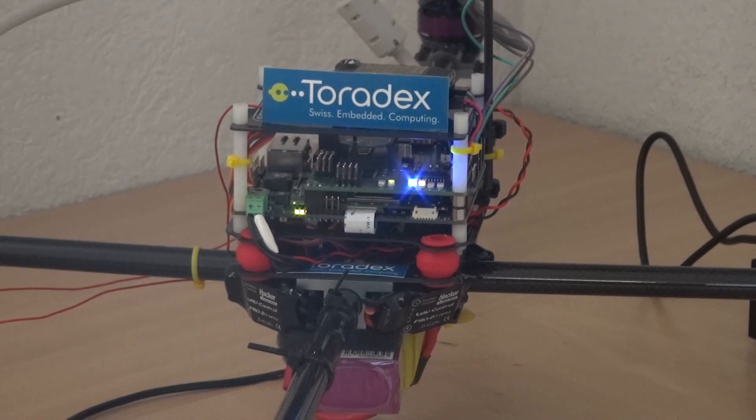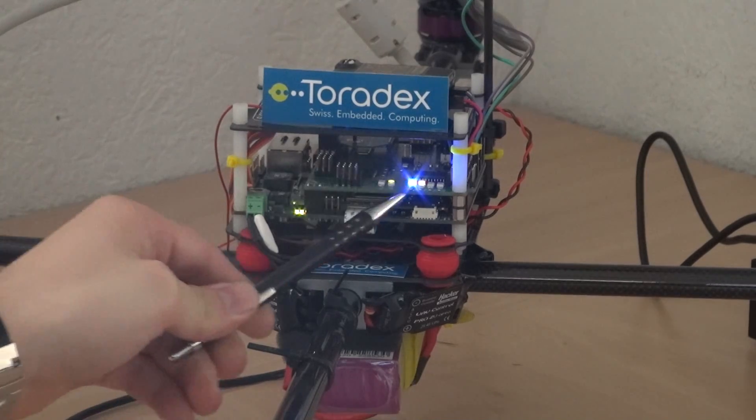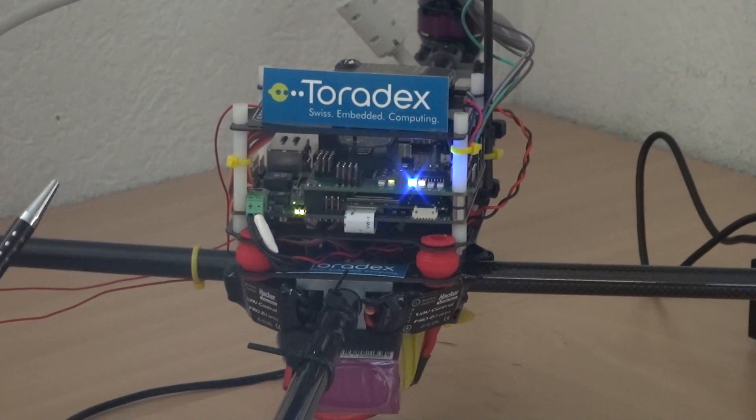Now I've started our program so the blue LED is on. This is because no remote control is connected. If you connect the remote control it will turn off, but this signals that the motors are safe — if you have no remote connected, the motors will not turn. This board with the LEDs we developed ourselves.